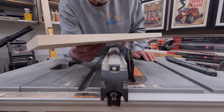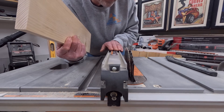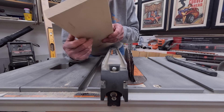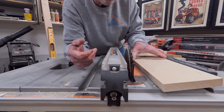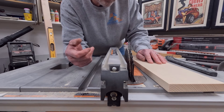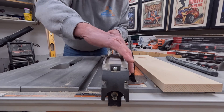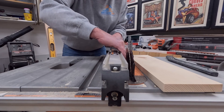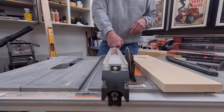That's also kind of why I selected this smaller piece of wood. We removed this guard so that we can cut these thin strips of wood, and these thin strips of wood are the ones most likely to eject from the saw. They won't ride up on the blade — they will stay laying flat right down in here between the fence and the blade and just shoot out towards you at a rapid rate of speed.